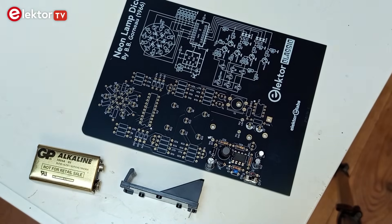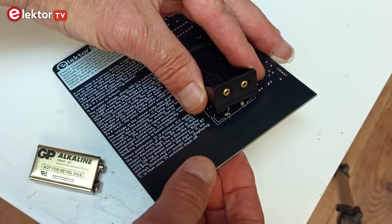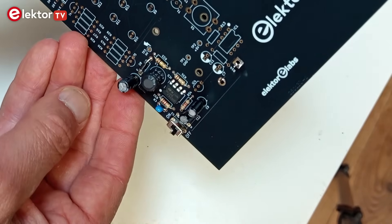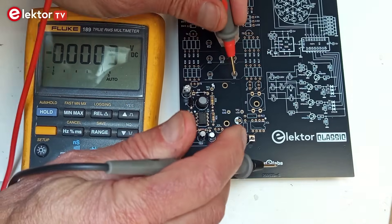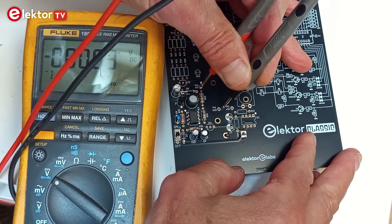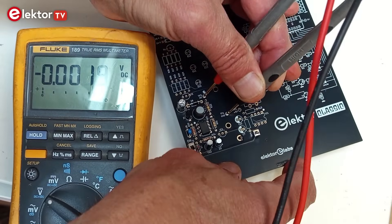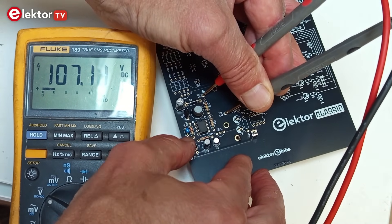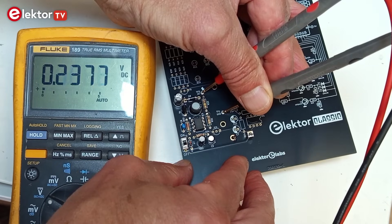When the power supply has been assembled, we can test it. For this you'll need a 9V battery. Do not use a mains-powered AC-DC adapter or power supply instead. Make sure slide switch S2 is in the off position, down. Solder the battery holder to the back of the board and insert the battery. Connect a voltmeter to test points TP1 and TP3. The voltage on TP3 will be a bit higher than 100V, so the voltmeter must be capable of measuring such a high voltage. Switch the voltmeter on and then slide S2 to the on position, up. The value displayed should be about 106 or 107V. If it is much higher or much lower, then something is wrong. Switch the device off and remove the battery.